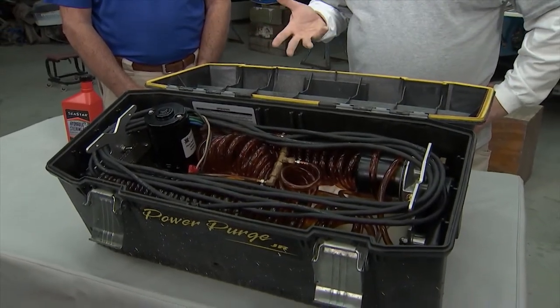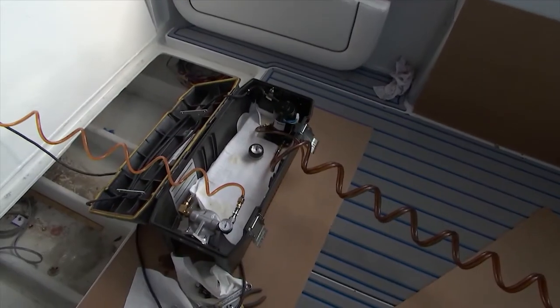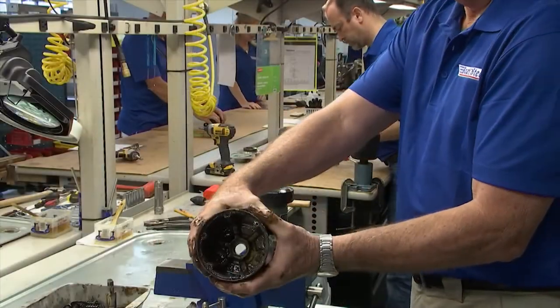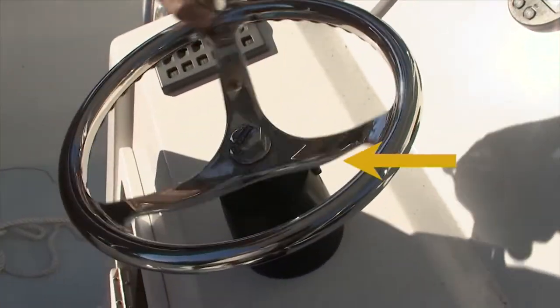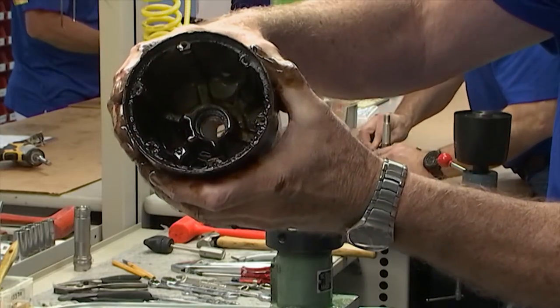Tim, most people in the audience are not going to have a professional piece of equipment like this. But occasionally you do have to crack the hydraulic lines to maintain your hydraulic steering — for example, your helms sometimes get what's called muddy. They get muddy because there's a vent cap on the top, and that vent allows air to go in and out. When the temperature changes outside, it brings a little bit of moisture in each time, which goes after the steel inside the helm and starts to corrode it, creating rust material that floats in the system. We call that mud.